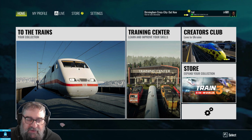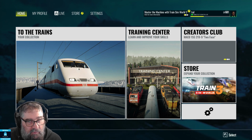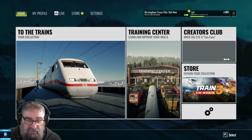Alrighty, our 3 positions are release, which reduces the brake pressure, making the brakes let go of the wheel. Lap, which maintains the current brake pressure, and apply, which adds more brake pressure, making the brakes hug the wheel like that aunt or uncle you don't like who smells funny and crushes the life out of you.